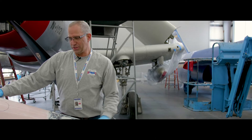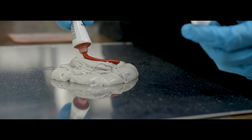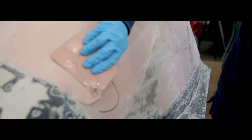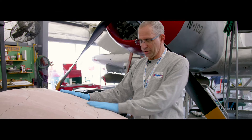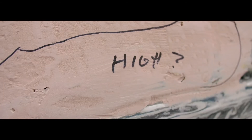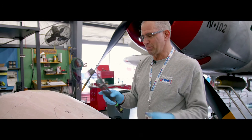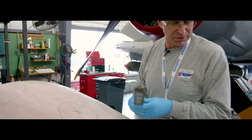One of the cons of working with this filler material is that it's an epoxy product, and once it is mixed with the hardener, you only have a limited number of minutes to work with it. So that's why we prefer not to mix too large a batch. After we fill a small area and it cures, we run our hands over it and determine areas that need more filler, marking those areas — as you see here — as a low, or in some cases a high where some filler needs to be removed through the use of either sandpaper or this rasp, which is similar to a wood rasp but constructed specifically for use with this filler material.